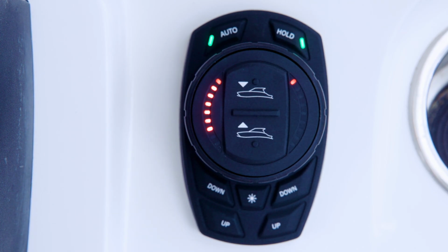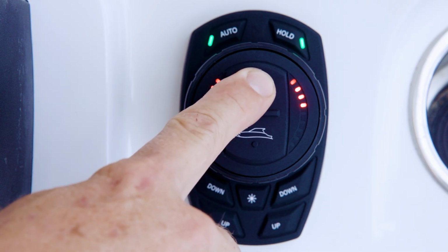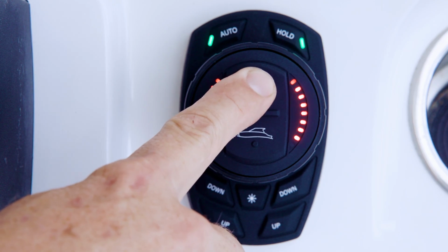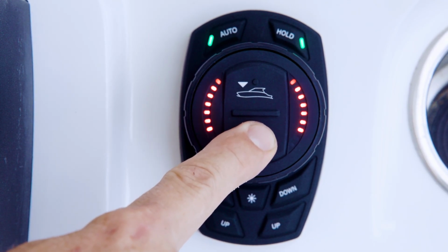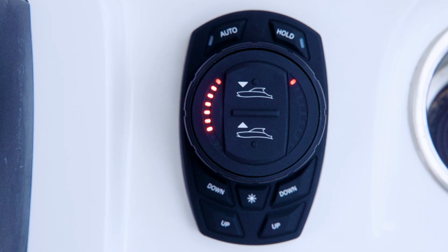There are 9 pitch offset options as indicated by the LED indicators on the right-hand side of the dial face. In order, each LED corresponds to a greater increment in degrees of pitch offset, beginning at 0 additional degrees at a minimum and ending at 3.5 degrees at a maximum. The on-plane delta pitch can be adjusted by using the all up and all down buttons on the dial face.